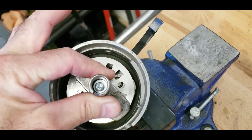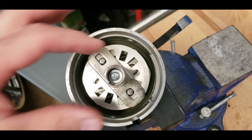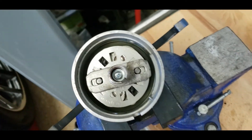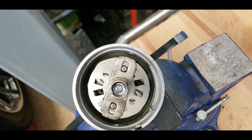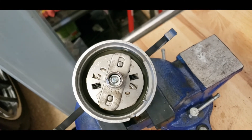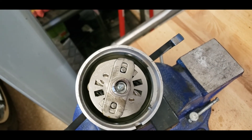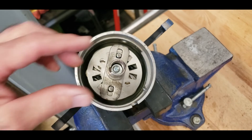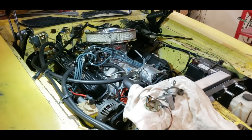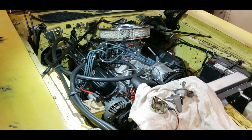It's an easy mod — I'm not going to show you drilling and tapping a hole; there's plenty of videos for that and most of you guys probably already know how to do that anyway. Take a quarter-20 washer, drill out the inside, sand down the flats — makes a perfect spacer. Tap the hole down through the shaft, put a screw in there, and it's easy in, easy out. That's the whole point of this video. Like and subscribe if you learned anything here — talk to you later.